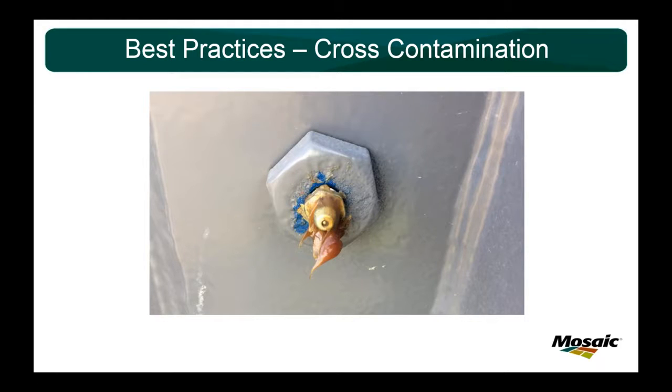There actually should be a black zerk cap that goes on this fitting because it's a 100 weight grease. So when the grease is a brown caramel color, you don't really know what kind it is. So a dollop of grease will get you by in a pinch. If I have a pack in my pocket of grease caps and I run out when I'm greasing motors, I'll leave a dollop of grease, but by the end of the week I will come back and put a cap on that motor, just because of the amount of protection it provides in our atmosphere, in our conditions: hot, humid, dry, dusty, windy, outside, all that stuff.